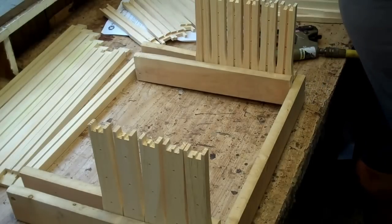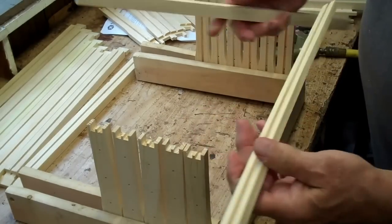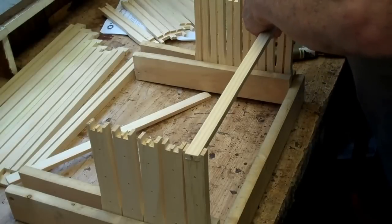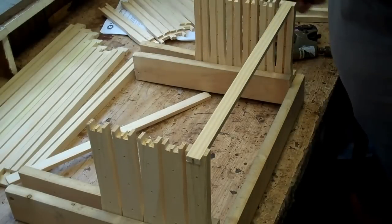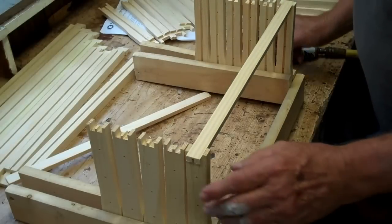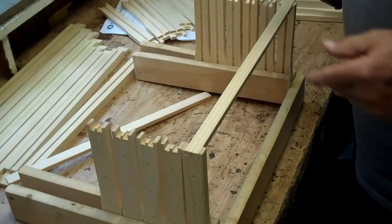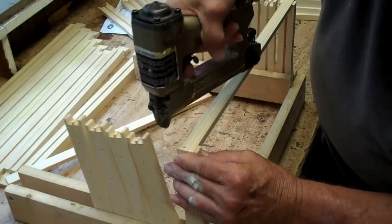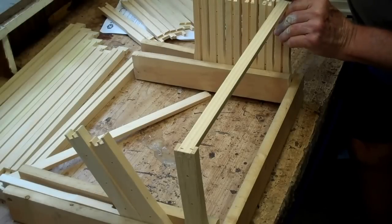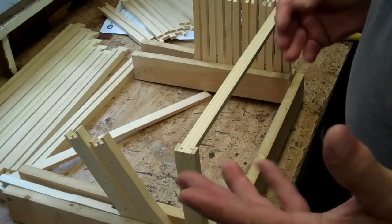This is the bottom bar and you'll see it has a slot on there. You want to get that groove — it fits on top of that middle piece, the way it's made. I'm going to square it. I glued it, and now I'm using a staple gun — they send you nails and you'll use those. I'll do all of them like that, and then we'll do the top.